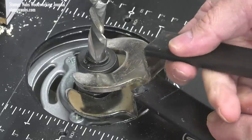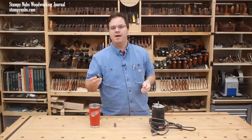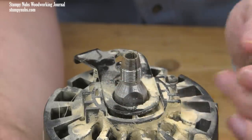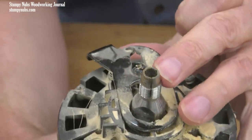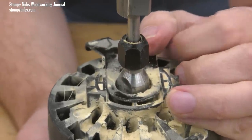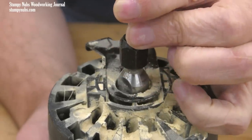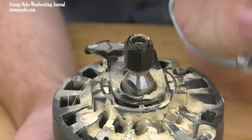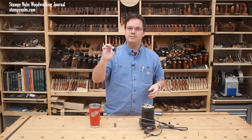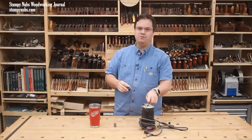So a wrench is again required to break that friction hold and then the bit comes loose. Now why do they call it a self-releasing collet when you have to use a wrench twice to loosen it? Well, take a look at this router. This collet is integrated into the motor shaft — it's just slit so the shaft will compress around the router bit as the nut is tightened over top of it. When you loosen the nut, the slit may spring back open and free the bit, or it may not. These often become jammed and you sometimes bang on them a little bit with your wrench to release the bit. But by drawing the collet up and out of the shaft, the self-releasing version frees the bit automatically as the nut is loosened. These never get stuck quite as badly as those.